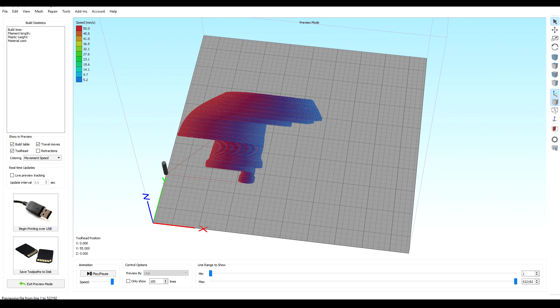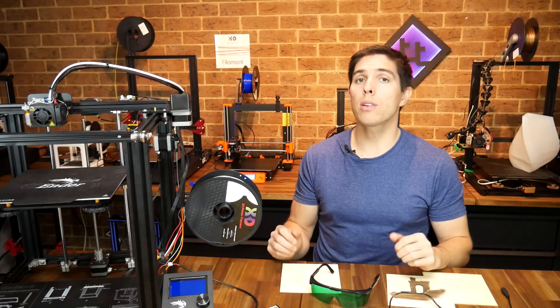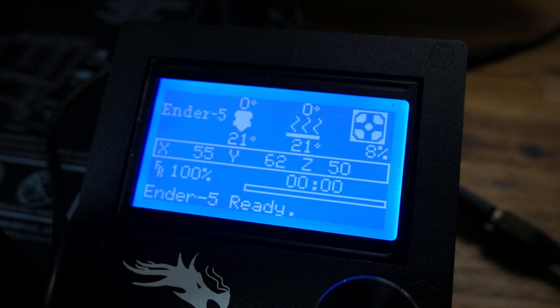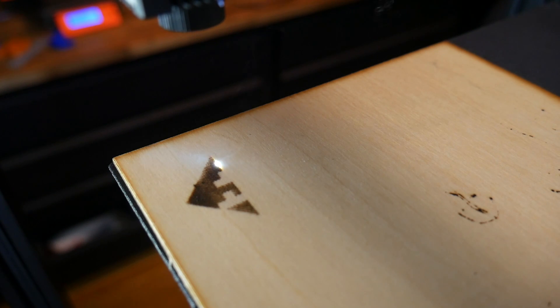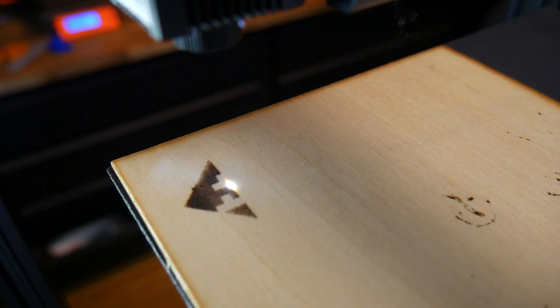If you open the downloaded g-code in your favourite slicer program you might be able to get a preview, especially if you tick show travel moves. It might look misaligned, but remember the laser sits 55 millimeters forward of the nozzle, so it will actually be in the corner where you'd expect. Also note the image has been mirrored — this is especially important if you're engraving onto something special. If you run the job tethered to a computer over USB you should see your part cooling fan dial go up and down, indicating the PWM being sent to the laser. Running the g-code off the SD card, the graphic on the LCD will also go up and down to reflect this. The laser remains on even in portions that aren't burnt, running with a lower PWM duty cycle in those parts, and through the camera we can see the intensity is modulated to etch the desired pattern.